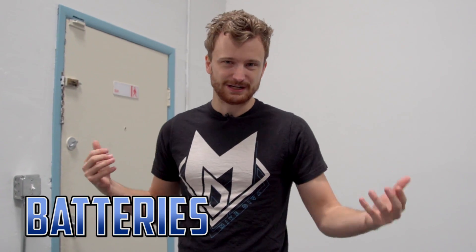The one other thing you need to think about is batteries. If you're going to be wireless you need a wireless power source. In this case I have a big battery to power the receiver — it doesn't need to be this big, I'll go into that in a bit. I also have another battery to power the monitor because the monitor draws a lot of juice. Let's break this down and show you guys what you need to get and how to arrange your system to build a functioning wireless monitor.